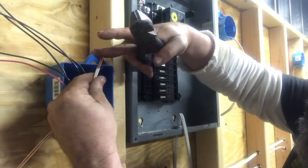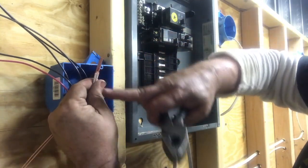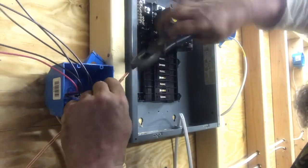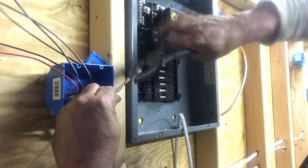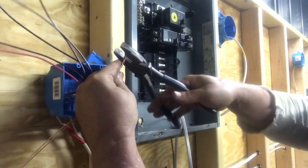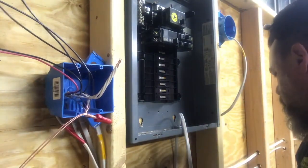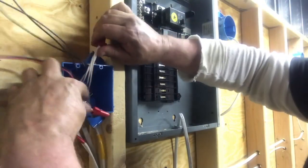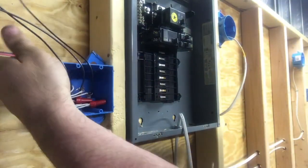See them all together, all even? Put them all together, all even. I want more of the sheathing — the plastic coating — to be even than the ends of the wire. Same thing with my grounds. Take them, twist them together. Once they're twisted together, kind of nice. Cut them off, even about three-quarters of an inch. Give me another red wire nut. I'm going to shove that ground back there. Neutral as well. Nice and neat.